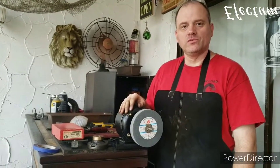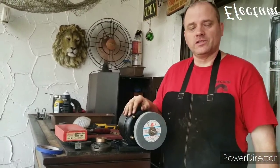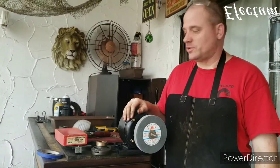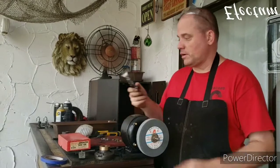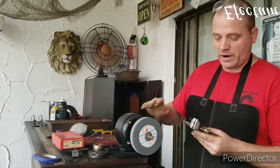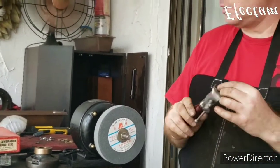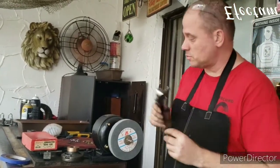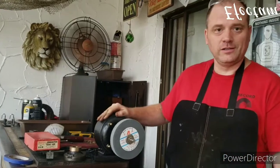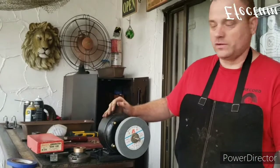So I'm cleaning up the screws from inside the rotor. A lot of them were pretty marred up, so it looks like somebody had been in there taking those screws in and out a number of times. I chased those screws through a die, and I got the threads cleaned up, and now using this Starrett hand vise, I'm using this fiber wheel here and just buffing out the heads a little bit. Not trying to make them look like brand new, but just cleaning them up a little bit, and this vise comes in real handy for holding these screws. And this motor, by the way, is a 1920s Ohio motor, so it's a nice little motor in itself. I never showed this motor on video before.